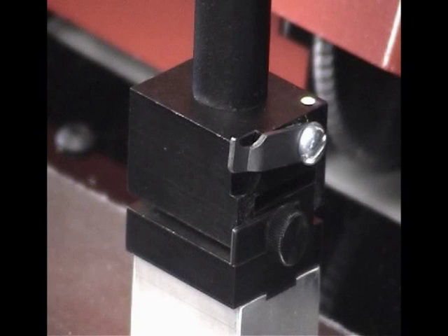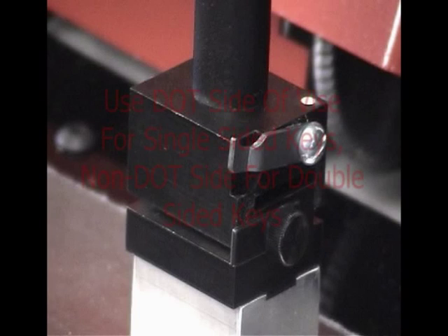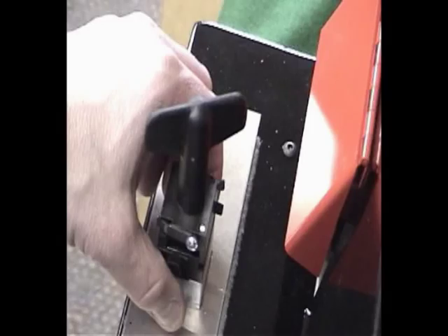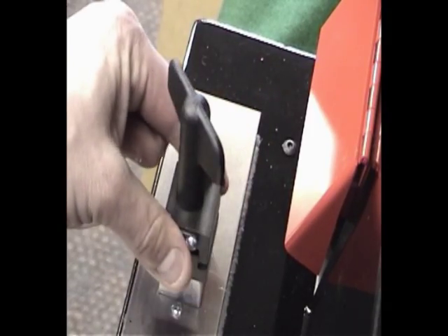The key vise is reversible and is probably the most important part of cutting keys correctly on the machine. You will notice that one side of the vise has a dimple or dot drilled into the top. This is referred to in the program as the dot side of the vise. As a general rule, use the dot side of the vise for cutting single-sided keys and the opposite or non-dot side for all double-sided keys. If you need to turn the vise around, loosen the T-nut and lift up on the base of the vise. Turn it 180 degrees until it snaps into place.